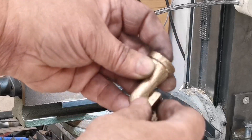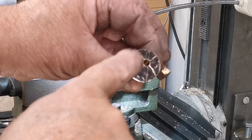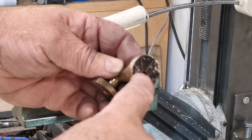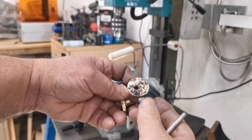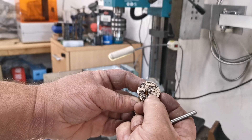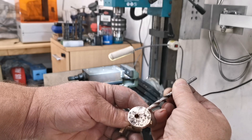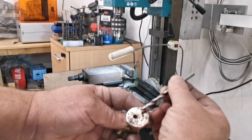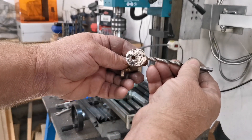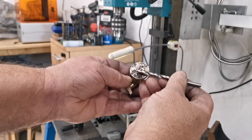That's that hole drilled, and that hole drilled which meets through to the bottom there. That hole will be tapped for the injector valve. The next two holes I'm going to drill — you can see I've marked that hole there and that hole there. What I've got to do is drill right in the back through there and come out at that hole there, and the same on this side through the back there and come out there.